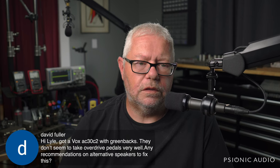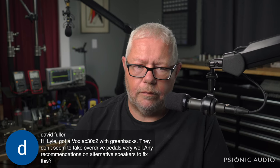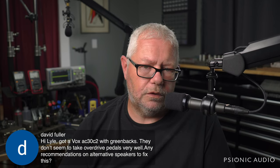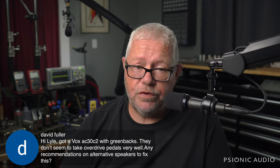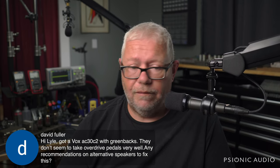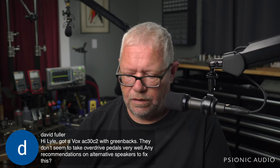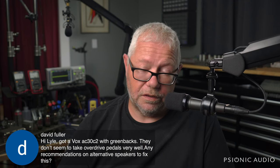Hey, Dave Fuller, your Greenbacks take overdrive pedals great. You probably, and I mean this nicely, need to learn how to sweeten up your tone stack settings. If you mean that it's getting fizzy from overdrive pedals, or is it getting mushy with overdrive pedals, an AC30C2 with Greenbacks will take pedals excellently if the preamp controls are set correctly. If you make that amp really bright and then you turn on an overdrive pedal, it'll take your head off.